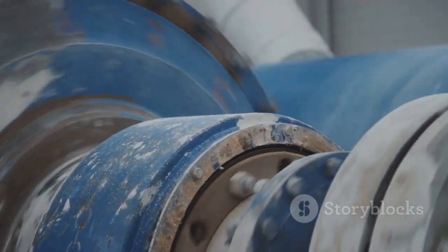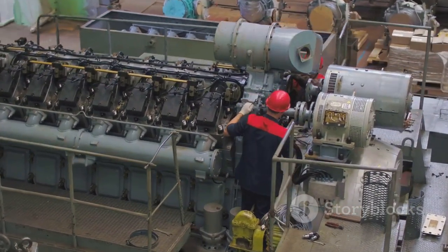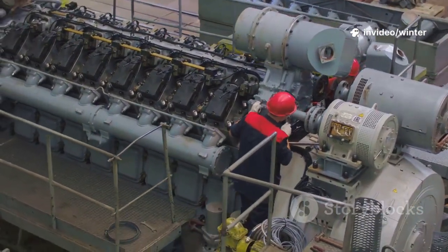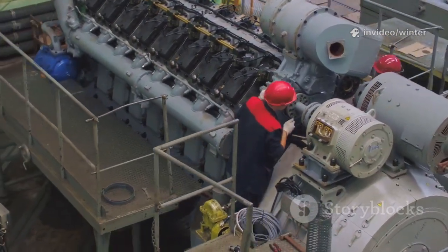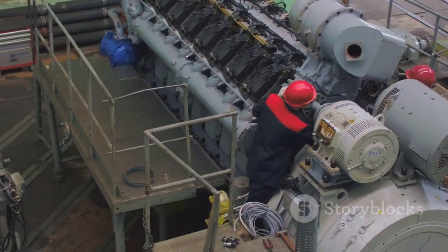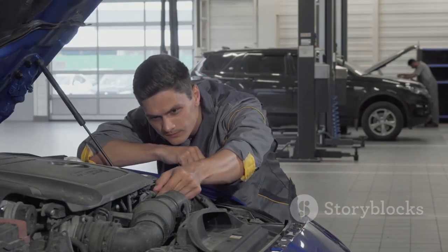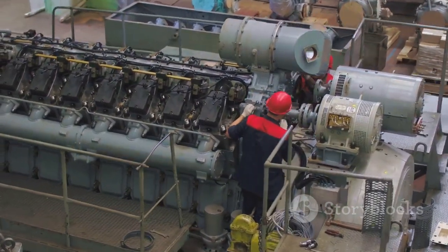Pump bearing health is no accident. It's the result of proactive, informed maintenance. Most failures are preventable. Focus on lubrication, contamination control, alignment, and correct installation. Don't just replace parts. Find and fix the root cause. Learn to spot early warning signs: temperature, noise, and vibration changes. Master the basics to turn maintenance into a value-adding activity.